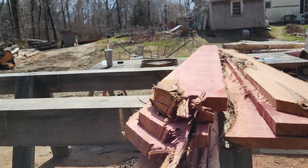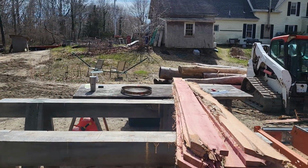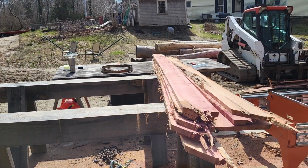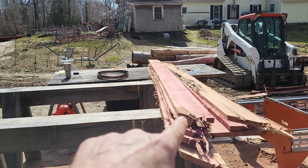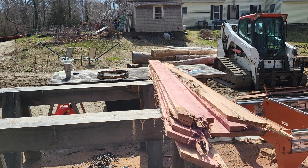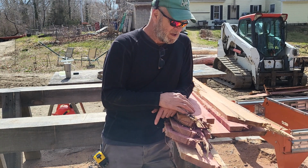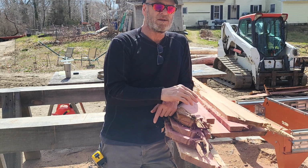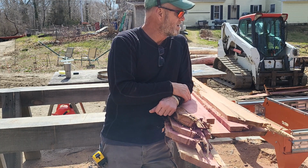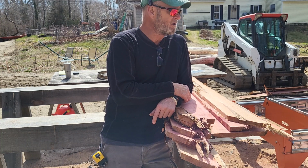The edges are pristine. The top of the lumber is flat. I know that those are only 1x6s, but I can tell you when my band starts to get whooped before with the ceramics, even if I was cutting 1x6s, anywhere near the speed that I'm pushing these through, because I'm humping through these, I'm not taking my time, the band will be going like this. That band is still cutting great. I think it's the guides. I really do, guys.